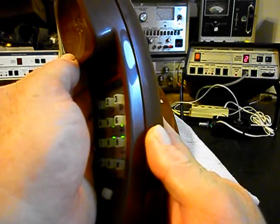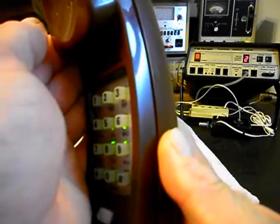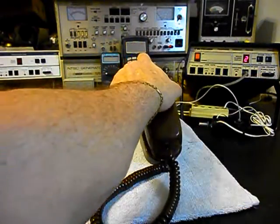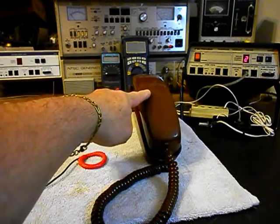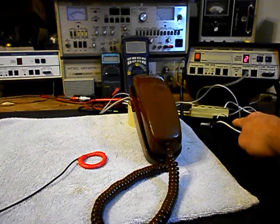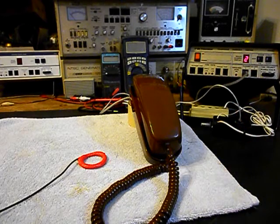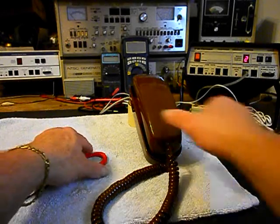Our keypad light does work, so the keypad is lit up — that's pretty cool. So now what we want to do, since we know that this unit is ringing in on a ring cycle, it's dialing out, and it has transmit and receive, we can go ahead and push this button on the switch box. That gives us a line out and totally takes the analyzer out of the situation. We'll call a time and temp number, so we'll go ahead and give you some dial tone and make that call.